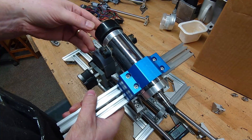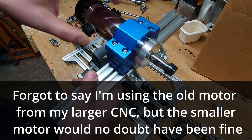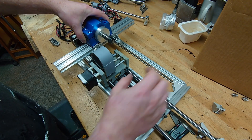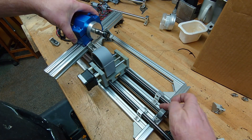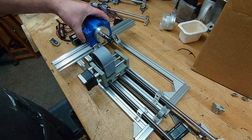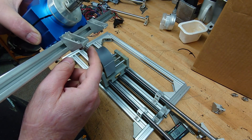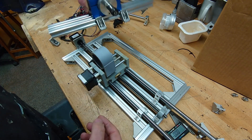So we've got the motor mounted on a couple of extrusions. I've got the little right angle brackets on there. I'm going to pick up on this rail and this rail. But to get it to the right height I'm going to need some spacers, so I'm going to make four 38mm high M5 male-to-female spacers, because I haven't got any bolts that are long enough. Otherwise I'd do tubular spacers — it'd be a lot easier.